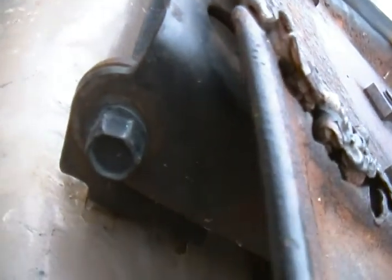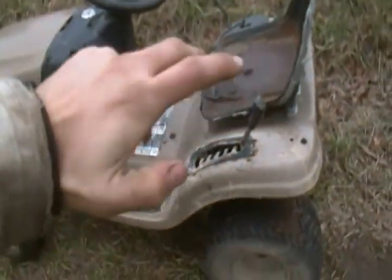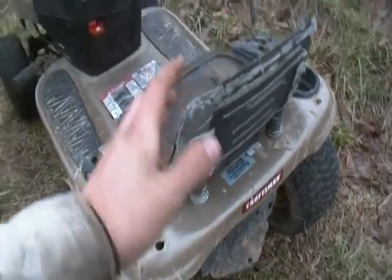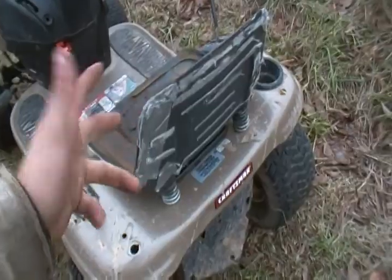The set screw actually fell off. Let me turn it and I'll tell you what happens — yeah, it's pretty bad. The pulley won't hardly turn, it's like grinding. I think the transmission — set it aside for a little bit cause it was in the orange mower — but it probably got water in it through a hole right there, and it probably messed it up.